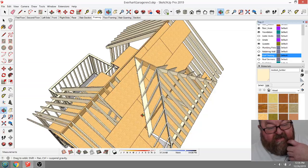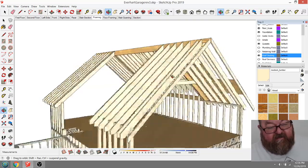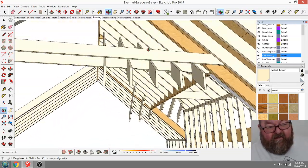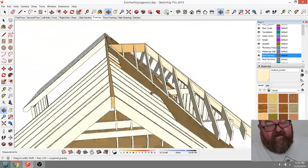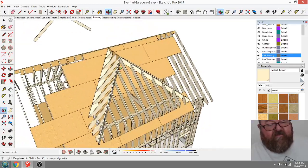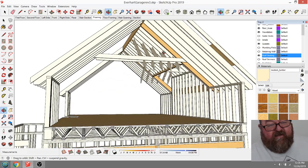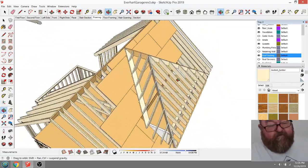To have a valley rafter that comes down, it's a waste of time, because all that work is just going to be in an attic. Again, if I was going to make this whole thing vaulted to where I could see that, it's kind of a mess with your drywall too, because if you have a true valley, the valley rafter is actually bigger and hangs down farther than the other rafters. So then you've got to fur down all these rafters to meet the bottom of that so that your drywall works out good. It's just a mess.